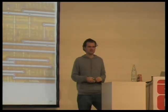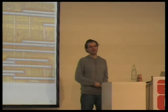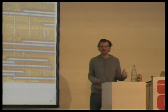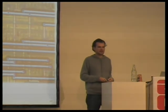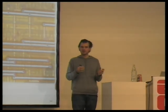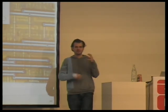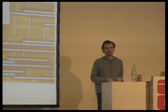Hello. So what would you do to secure the chip? Good question. Let me cite Krzysztofowski here, who has been breaking microchips for at least 15 years. He says, everything helps, but nothing is perfect. So try to be a moving target, try to have as many different security types in your chip as possible, and keep replacing them. There's this company, NDS, they make satellite smart cards and sell them kind of expensively. Every batch of their chips, from what I understand, is somewhat different from the batch before. So they never manufacture many chips of the same type and just keep moving, so nobody has a huge incentive to break them, because you can only ever break a small number of chips. That's probably the best advice I can give, but nothing is perfect.